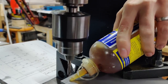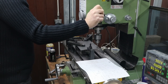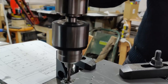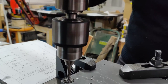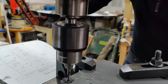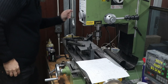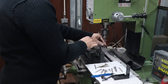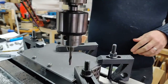As you will see throughout this video there are a lot of tool changes — a lot of holes, a lot of tool changes. You can see the plan on the left there. This piece has eight holes for the rails that are all drilled and tapped, then another six holes for the lead screw mounts also drilled and tapped, and then another ten holes for the mount points onto the x-axis carriage. Those are all drilled through.